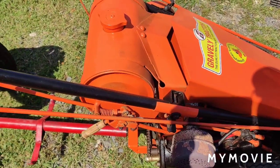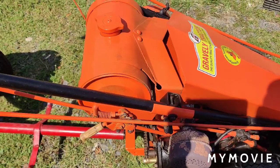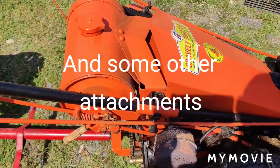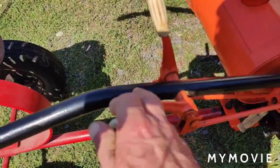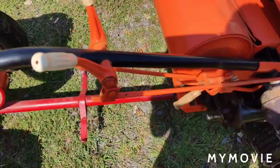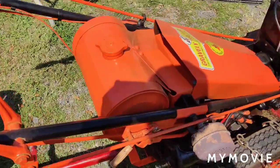If I think of it, when I'm out in the field there, I'll shift it into low range. The low range is good to have that really low gear for when you're snow blowing. This way you're not riding the clutch. What I mean by that is you just leave the clutch engaged all the way, and you're not burning up the clutch by riding it, because you have that real low gear you could put it in.